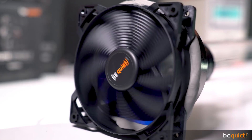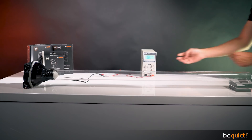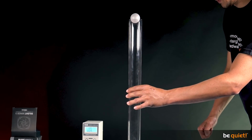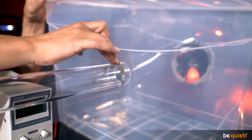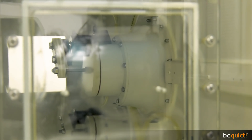Our first testing environment was quite simple. The funnel focused the air and let it into an acrylic glass pipe. Unfortunately, this led to the so-called pushback effect — the swirled-up air got reflected off the funnel and bounced back. So we devised an airtight chamber and sealed its two openings with clay, thus creating a simpler version of the complex fan testing chambers used in our production facilities.